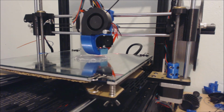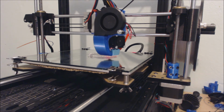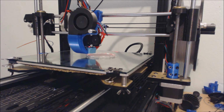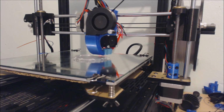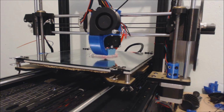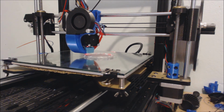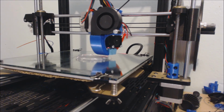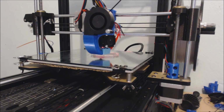So yeah, this will be a sacrificial one. I might play around with the temperatures a little bit. I'll do some weird stuff, but the biggest thing is start writing this stuff down. Now, with the Duet Wi-Fi, the machine status gives me its current location in millimeters. I'm 3.73 millimeters high right now. So what I can do is take a little scrap piece of paper, write down 10 millimeters, and write down what I changed. So afterwards, you don't really need a measuring device to see where you made the changes, because if you can't find it visibly, then it obviously wasn't an important change. So I'm gonna do that. I'm just gonna play with the settings a little bit and see what we can come up with, and we will go to time lapse.